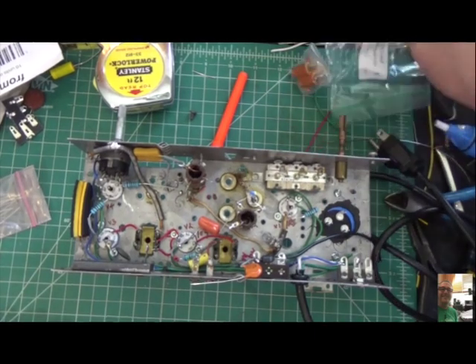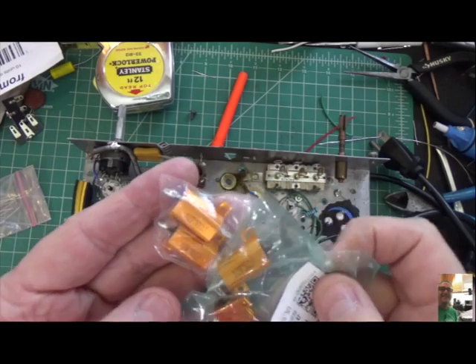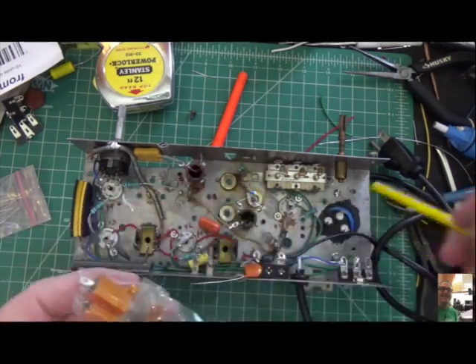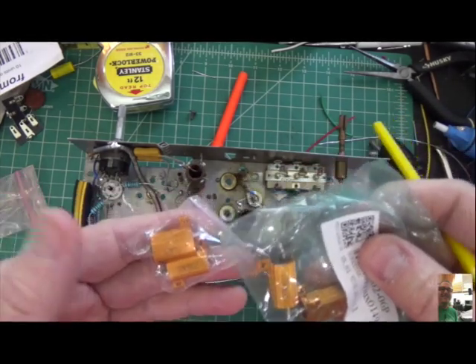The plan with the power section is to now test the resistors. These are the resistors I'm going to use - there's a 50 ohm and a 5 ohm - and I'm going to mount these somewhere inside the chassis, but first I'm going to just do a gator wire test and make sure the voltages are good.